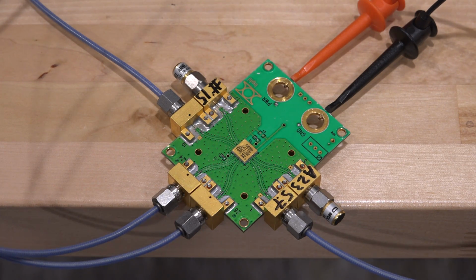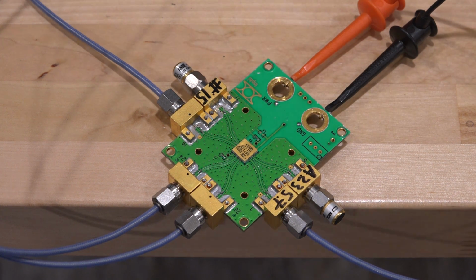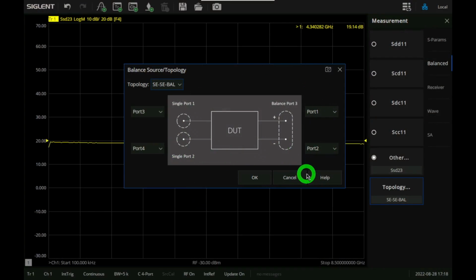So it's using a splitter amplifier internally. So the matching of that in terms of phase and amplitude can now be analyzed. So using this topology now, we can go ahead and measure the response to each individual output of this amplifier splitter device that we have.